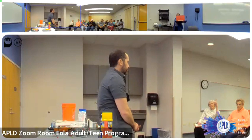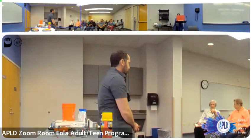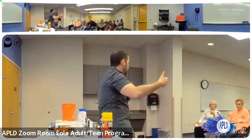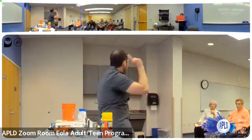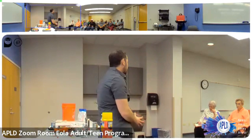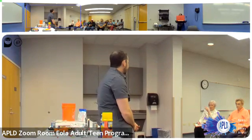So, but the garage door chain, yep. Is the WD-40 all you need? No, the WD-40 is fine for the rollers and fine for the rubber seal on the bottom. The chain, you actually want to get chain grease. All the big stores that sell anything for garage doors will have that. It goes on the chain. WD-40 goes on the rollers. So you just rub it on there yourself? Yep.